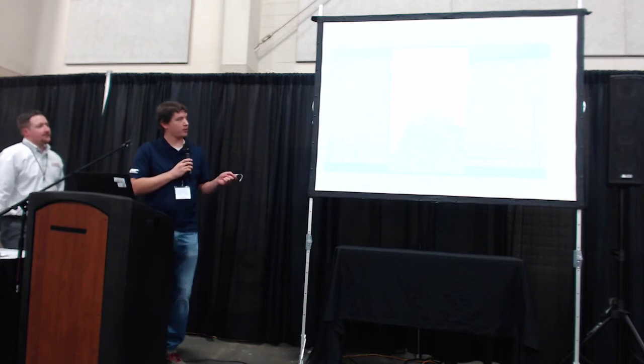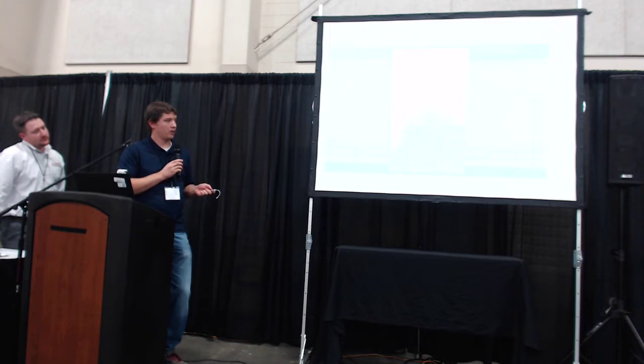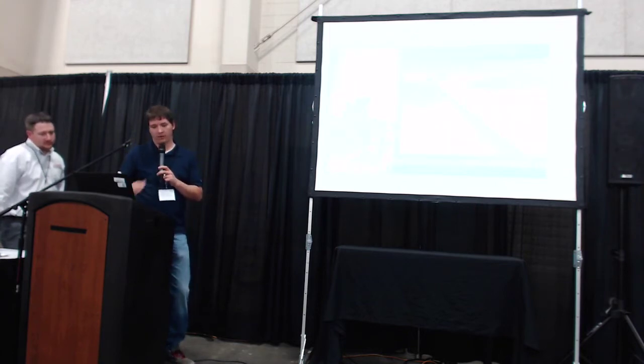Right through here, it's a little bit low through there, slightly segregated, but I was walking around taking pictures, I stepped on it, and I felt it move. They were kind of in a taper right here, in the end of a taper, so it wasn't that thick, but there was a soft spot underneath there that you could feel. So as you're walking around, pay attention. You can feel some of those areas, but there's a little bit of a soft spot there. It's probably why you can see that dump truck or the backhoe track, because it was moving a little bit. Anyways, you can feel it as you're walking around. Just pay attention as you're walking around the job.